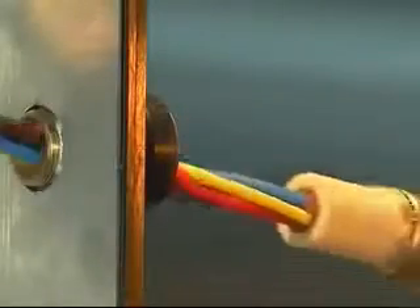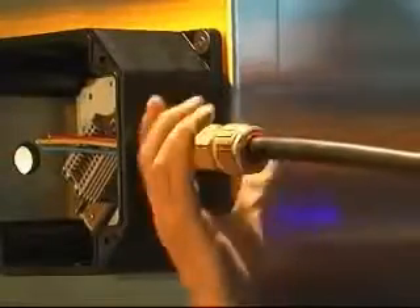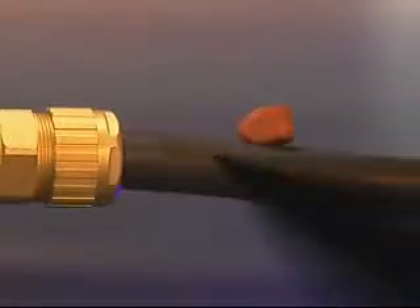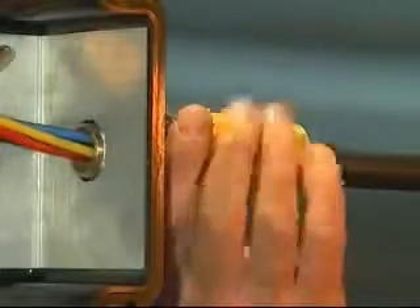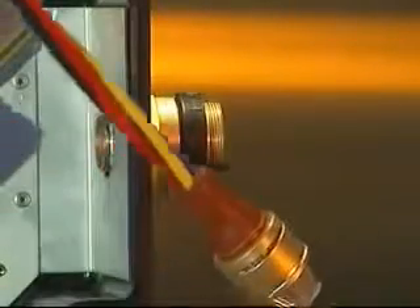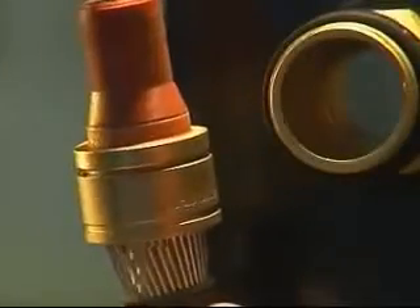Pass the cable assembly through the entry component and locate the pot inside the entry. Bring up the middle nut, locate on the entry and hand tighten. A handy tip is to apply the surplus compound onto the outer sheath of the cable in close proximity to the cable gland; this can be tested periodically to ensure the compound is hard before finalising the termination into the equipment. Allow the compound to cure, then untighten the middle nut from the entry component to enable inspection. If necessary, the compound pot may be removed for inspection to ensure that the packing around the conductors is satisfactory; if required, gaps and voids can be repaired by the addition of further compound.